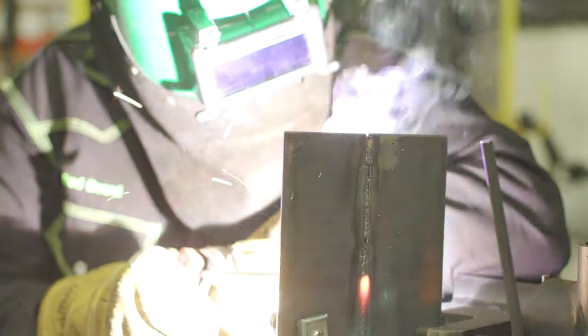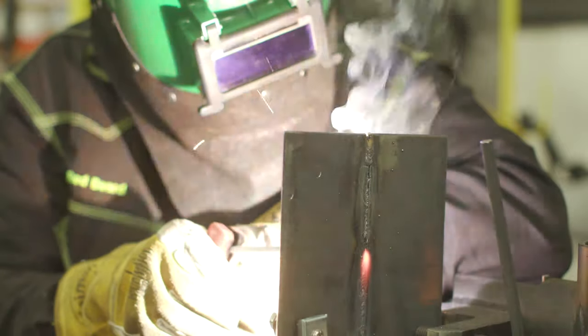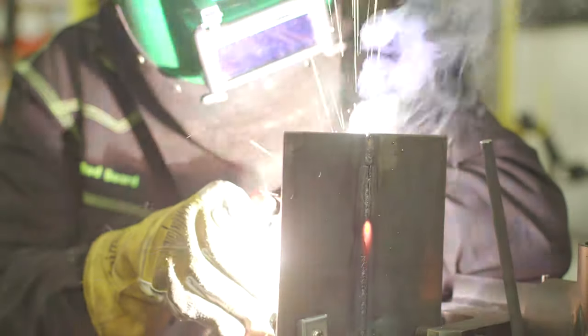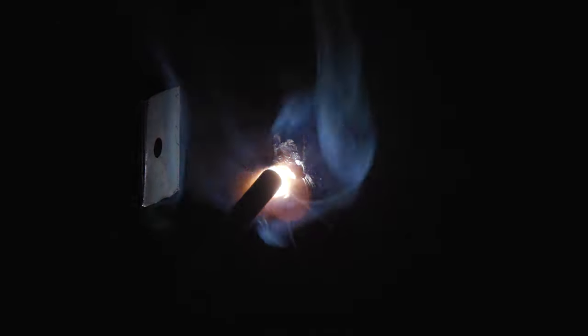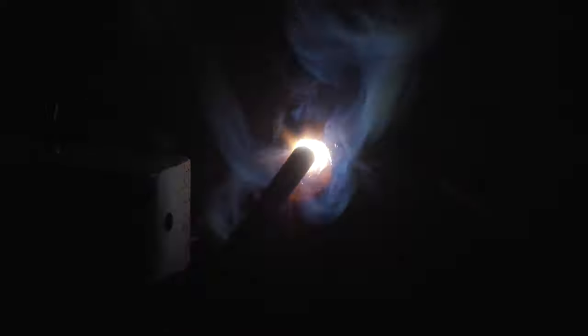We put the fill in off camera. This one here is about flush with the plate — some spots a little bit higher. Typically I like to keep my fill pass a sixteenth below the weld surface. If I can do that, I can almost guarantee I'll fall under that eighth-inch cap that I want to put on here. For the sake of time I'm going to put a wider pass on here than normal — just bouncing from side to side and taking my time in the middle. This is exactly what you do not want to do. I'm trying to replicate a high crown in the middle to demonstrate excessive weld reinforcement.